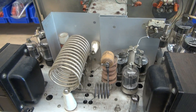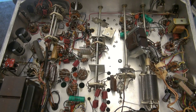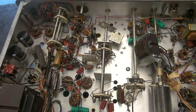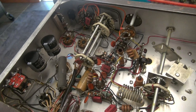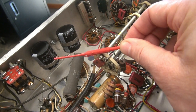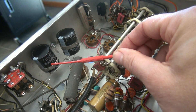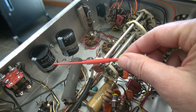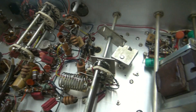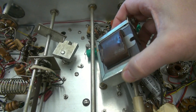Here we are, bottom side of the Valiant. I always give these things a thorough inspection before doing any work or powering her up. You can see there are some new filter caps over here - these filter caps were rated at 220 microfarad, 450 volt. The original Valiant had 80s in there, so I'm concerned about those putting too much load on the rectifier tubes. The other thing I noticed is this choke - it was only held in by one screw.